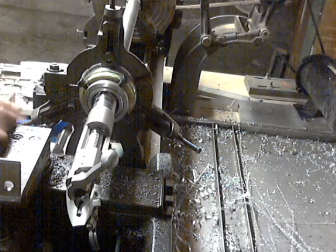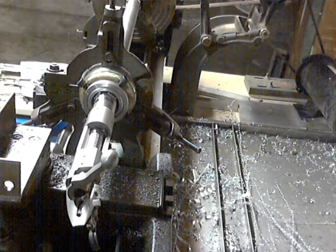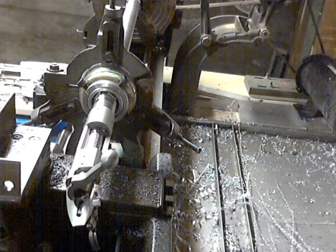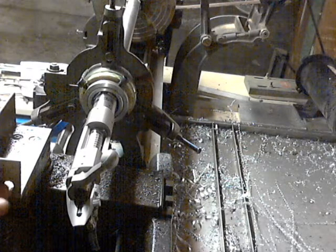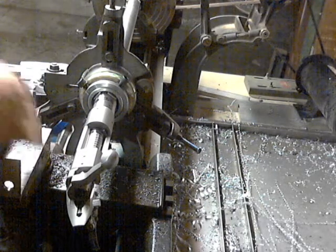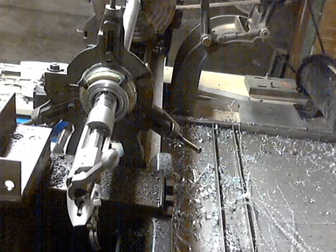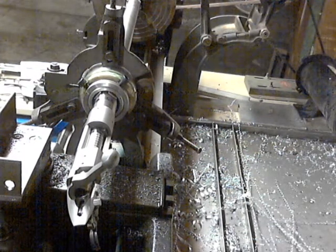So when you look at this piece right here, it's milled on the bottom and milled on both sides. The functionality of it is perfect. I could have machined all these sides, made everything perfect, shined it up, painted it — but why? Function's great. I'll oxidize these surfaces so they won't rust. And I have a beautiful jig that took me about a half hour to make. Thanks, and I hope you've enjoyed it.